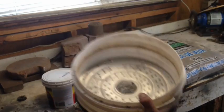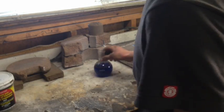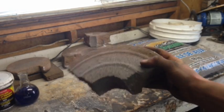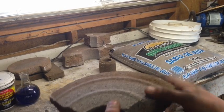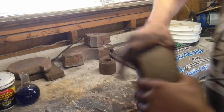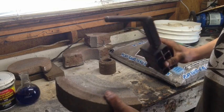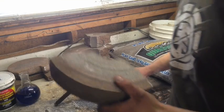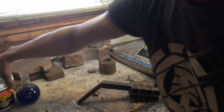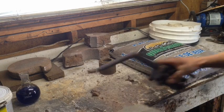If you want to make some irregular shapes — like a new lid to my foundry — this is how I'm going to be making it. Here's an example of what we're making — this is a stress test piece. I fired it until it was red hot. You can see the discoloration where it's been fired glowing red hot. It's strong — you can't really break it unless you really try. That's just straight sodium silicate and play sand, and it comes out remarkably well.